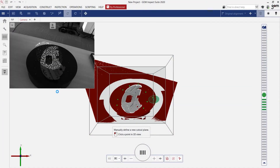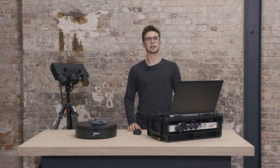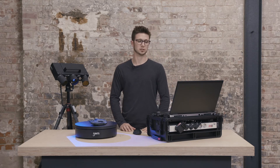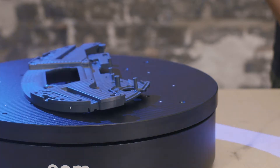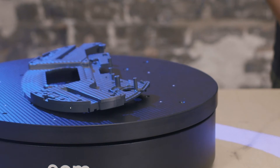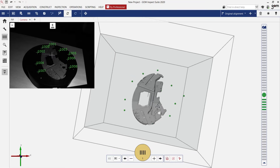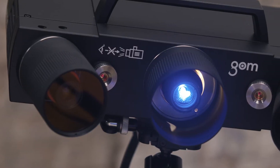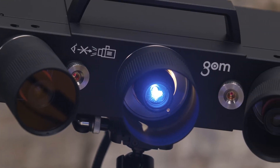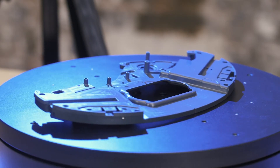When this is done, we can use a rotation table to make our first measurement. I will measure again in 8 steps to cover the complete 360 degrees. I'm using the automatic rotation table because it makes the scanning very easy, but it is also possible to move around the sensor or to use a manual rotation table. After the first scans we already have a lot of data, thanks to the triple scan principle. This principle combines the data from the left camera, the right camera and the projector unit, which means that we can easily scan inside deep holes or around corners.